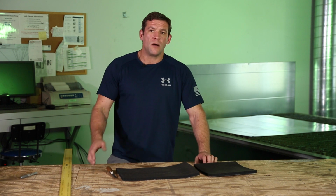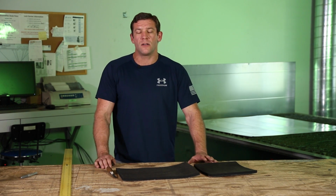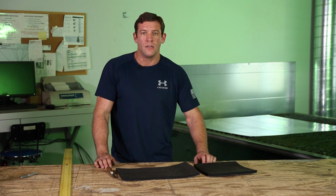So if you're getting into a complex system that has a lot of turns in it, normally rectangular duct is actually easier from a lining perspective, whereas round pipe's a little bit more difficult. But if you have just one section of duct and you're making one turn, you can run round pipe all day long and you just have to deal with one 90-degree elbow.